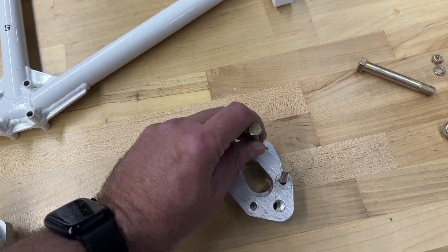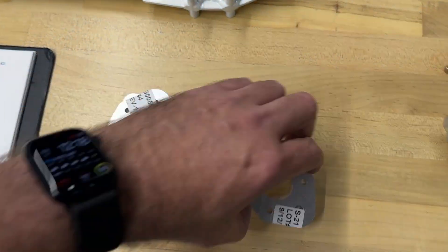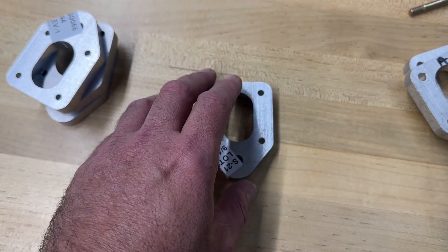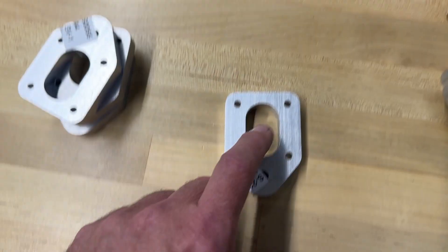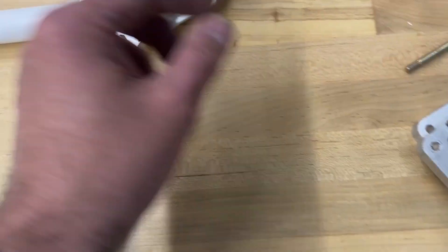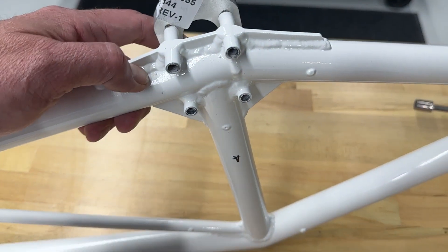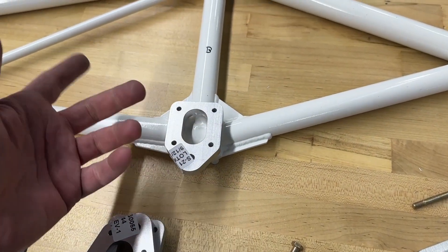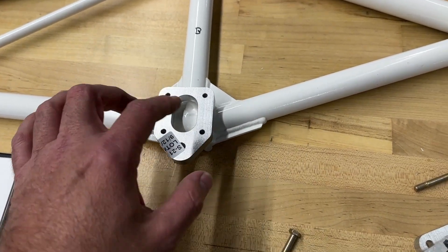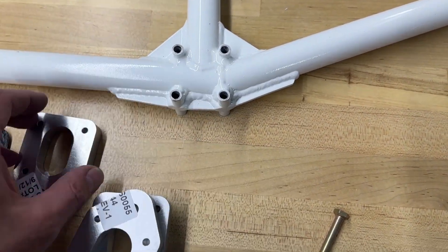Here's what I did wrong. What you're supposed to do is take one of these fittings - they are drilled to 3/16ths, these are quarter inch. The reason they do that is because you can't do a weldment here and hold the same tolerances that you do on a machined component. So you open up one of the holes to quarter inch, set it on there, bolt it up, and then you come back and drill through the opposite side and put another bolt and do the other two. That way you're opening up these holes, but they may not be concentric with the holes already there, just because of the way the weldment ends up not being perfect.